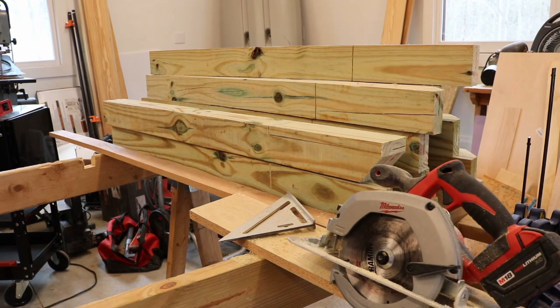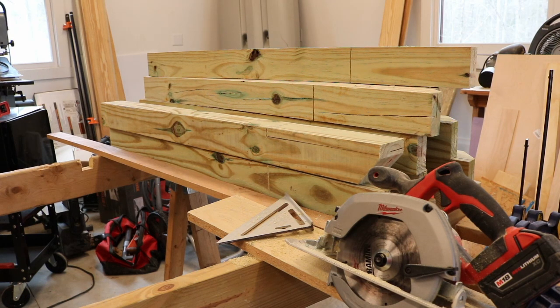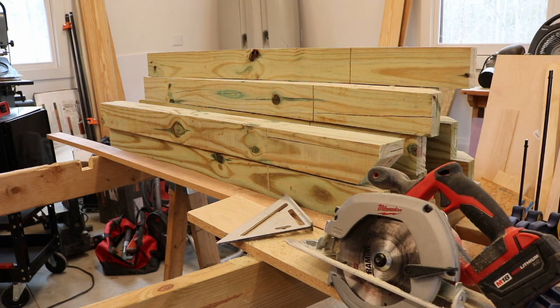All right, I've got 9 almost done. I'm not very good at doing notches. I kind of have to use multiple tools to get it to where I feel it's quality enough. What I did first was, as you saw, I used the circular saw to do the first cut, used the hand saw to do the notch cut, and then I'm going to finish off with the hand saw, using the circular saw kerf as the guide, because I'm not real confident about my ability to match up the kerfs if I used the circular saw totally. So anyway, it'll work. Bear with me, have patience. Stay tuned.